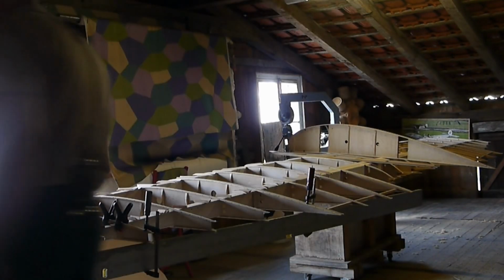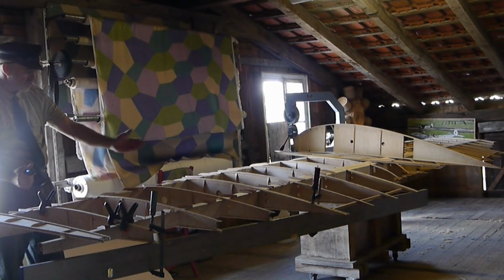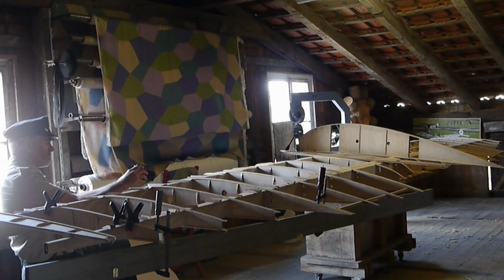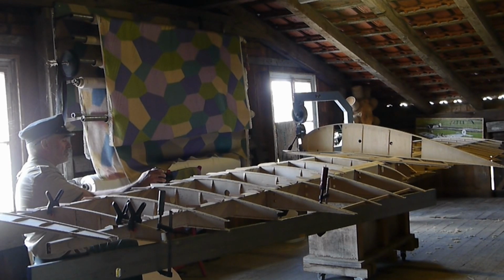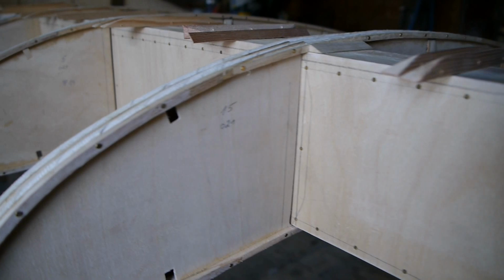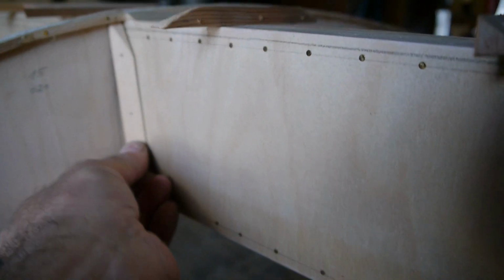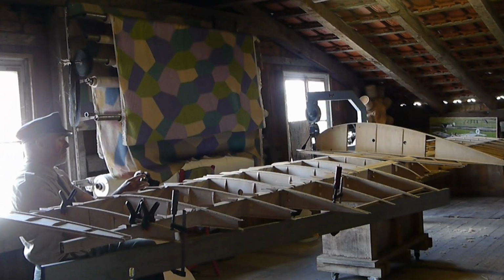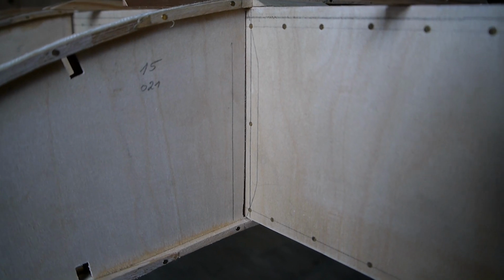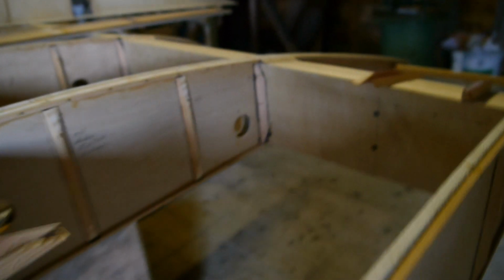And now I show you how the wing ribs are secured to the spar by means of the triangular corner gusset, wood strips or whatever. We talked about how it is once the ribs are slid on and have that little gap that actually enables you to adjust them on the wing spar. Let me show it to you once again from here, maybe the light is better. You can clearly see the gap on the adjusted wing rib. This will be closed and covered up with glue and the triangular corner gusset. Like so. Oh, upside down. Well, like that. Sometimes it drops. Happens. Anyways, as you can see, I've laid out with a pencil where it has to come to rest, and this area is then glued, and eventually it looks like this, nice, well, nice is relative, with the Aerodux 185.